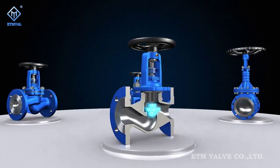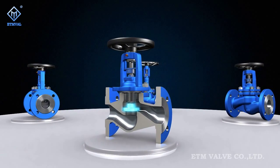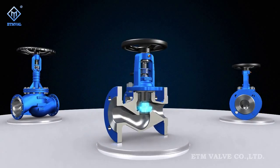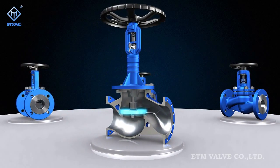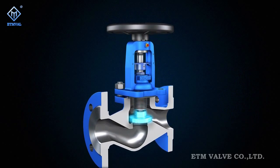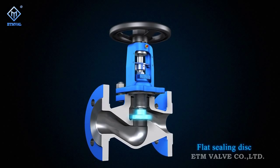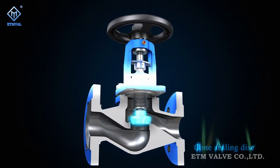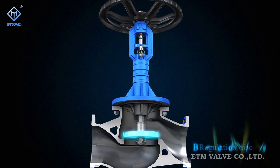In order to adapt to different working conditions, this new functional modular Figure P series can quickly produce a variety of variants and even offer special designs. For example, the disc of Figure P series can adopt flat disc seal, cone disc seal, throttling, and a balanced double disc design.